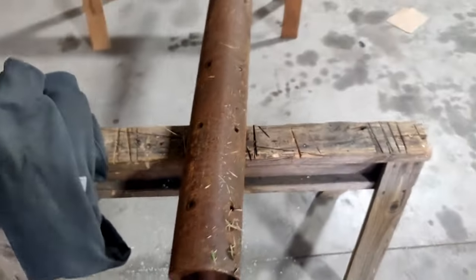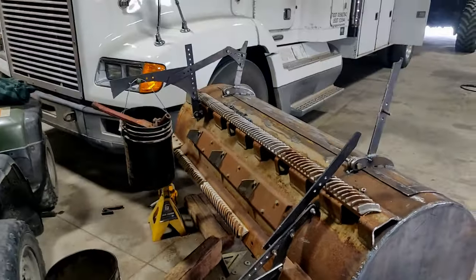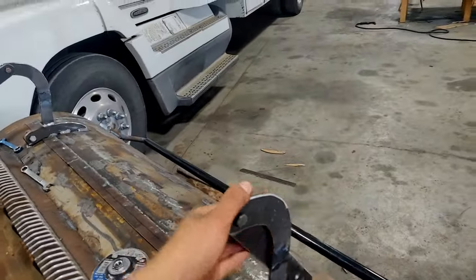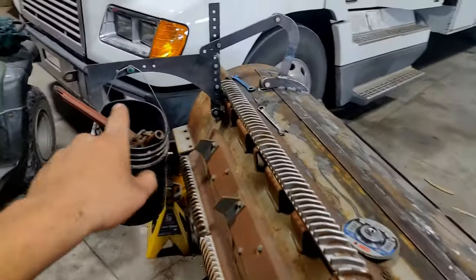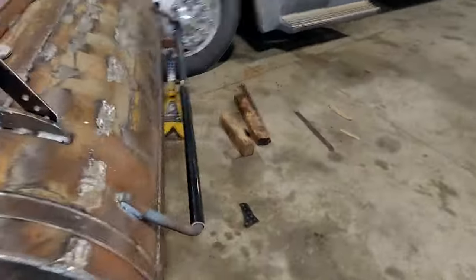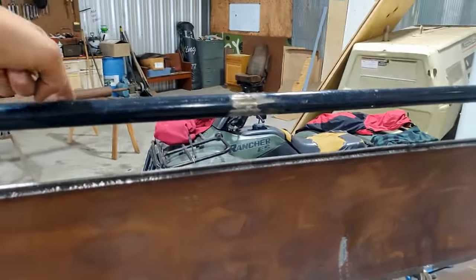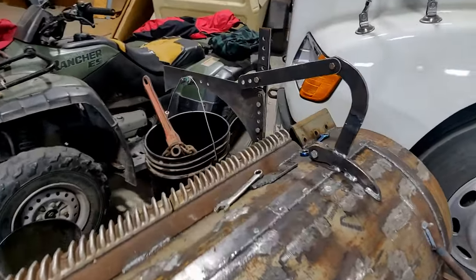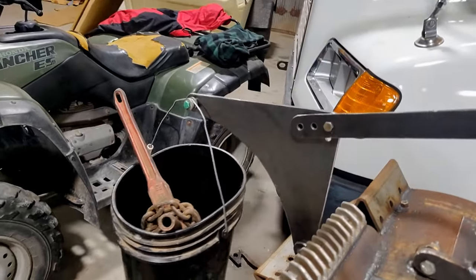I have this accelerator roll shaft that I think is a little too heavy, so I'm not sure what I'm doing with that yet — I was going to hang it between the two arms so it can go up and down. It takes so long to make without a CNC. I've been working on prettying up my links, rounding over corners, and I moved the pivot down two holes so when it's up it brings the bucket closer to the drum. Hit the sweet spot — absolutely effortless. A water jet or CNC plasma would make quick work of this.